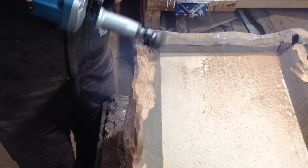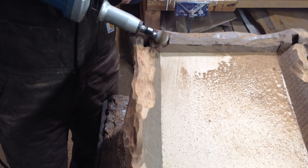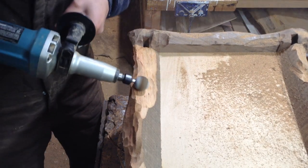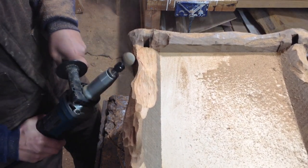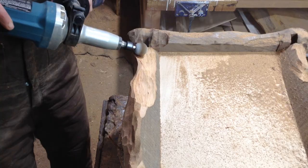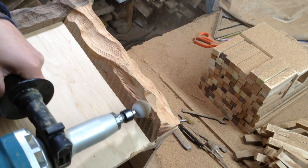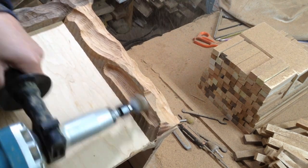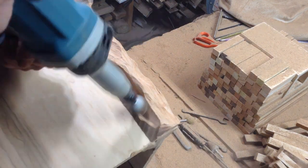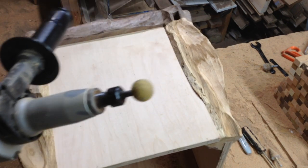You can see I'm just creating a curve with the angle grinder, and then I have a die grinder that I'll use to really amplify that curve. If you don't have an angle grinder, die grinder, and rotary tool, you can do all of this carving with just a regular Dremel and a multitude of bits. I use all those tools because I have them — I like keeping the thicker bits in the die grinder and thinner bits in the rotary tool so I don't have to spend time changing out collets.